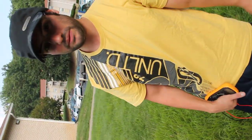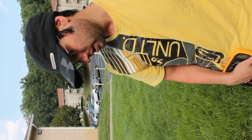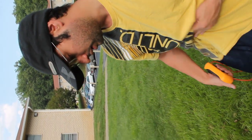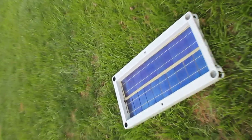The build went pretty well. One tip: do not use a 140-watt soldering iron to do this. I went through two tips soldering together just twenty cells, and it was more of a hassle than it's worth. Cheap thirty to forty dollar soldering irons are the way to go. Don't forget to hit like and subscribe, and check back for more updates on this project as it progresses.